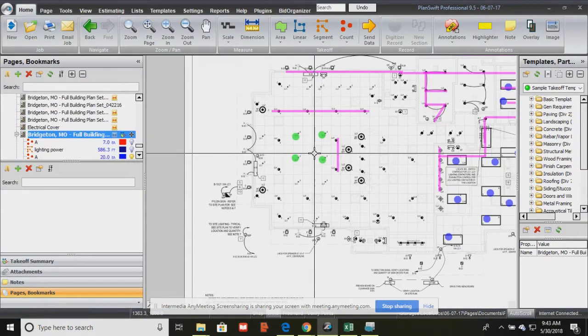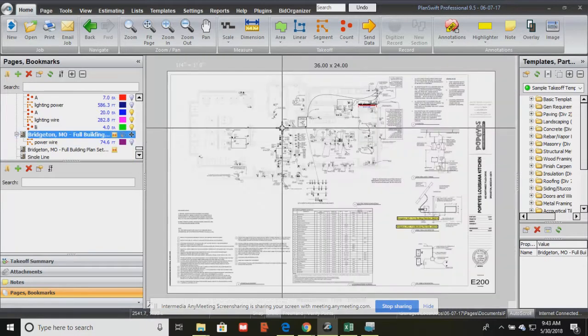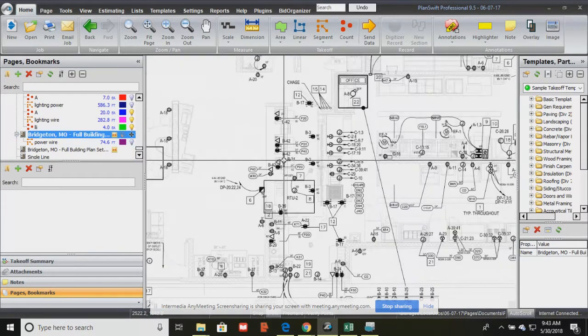You can take a lot of liberty when you get a set of plans like this. But the main thing is to put something as opposed to nothing. You want to give it a good, educated guess as far as the conduit, and that's what I do all the time. I've had pretty good luck with my electricians. We won a lot. Really, the switchgear is what it is, and all of the fixtures are the price that they are. The only thing you can play with is how accurate I am with the conduit and what kind of labor rate I'm charging. So we do pretty good.